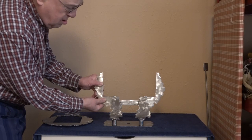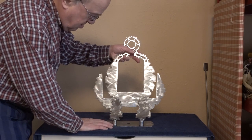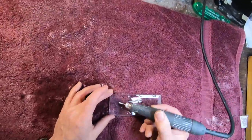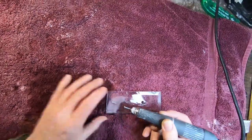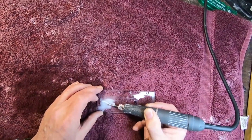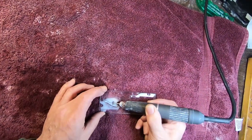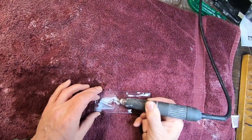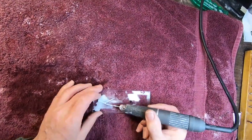Here I'm doing an initial modeling of the metal part of the sculpture alone, as I'm getting ready to start working with the glass. Here I'm doing the glass engraving — this is full engraving, not chemical etching. Using a diamond ball tip and a high-speed rotary tool, similar to a Dremel but operating much faster, it uses lots of water and lots of patience. This is not a hobby for those who want instant gratification.